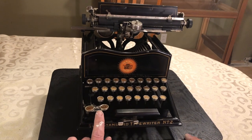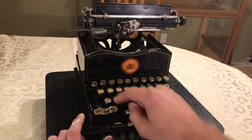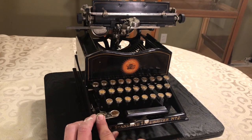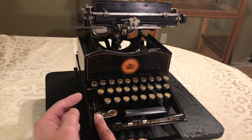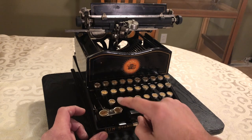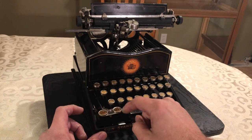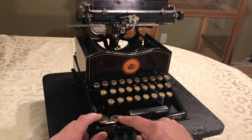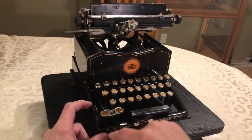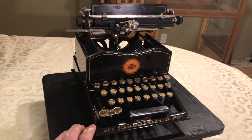The shift mechanism was pretty creative as well. Of course, you have the capitals and figures, and since it's a three-bank machine, the bar comes right out here. When you push down on the capitals, that bar goes straight down into the first notch. If you want to lock the carriage up on the capitals setting, you move that lever over. The figures position is way over here — when you push that down, you can see this bar move; it twists a little and moves the whole thing over into that lower notch, and then you can lock it into place. It's a pretty seamless operation, which I thought was pretty creative.